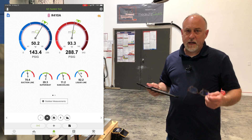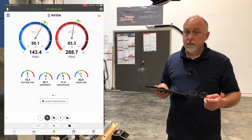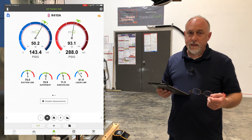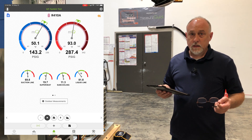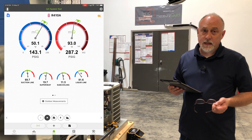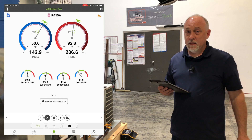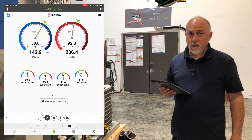So it gives you an idea how the whole system works and what you can do with it. When you do see this on there, start looking for return air leaks because odds are that's what you have. This should give you a good idea about how that works and why we can't rely on a single return air probe across a huge duct, and why we need software to actually make these types of diagnostics — it makes it a lot faster and easier to catch what you might have overlooked. You might just move your probe to the other side and find that you really do have a problem you otherwise would have missed. This is Jim with MeasureQuick — thanks a lot for watching.